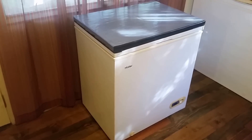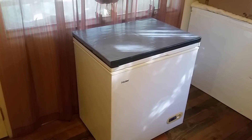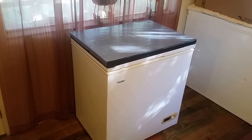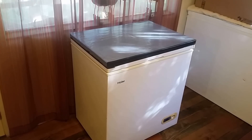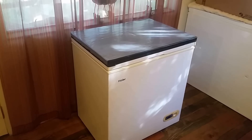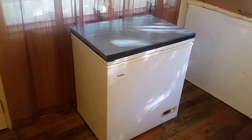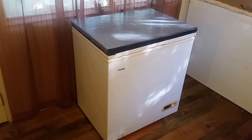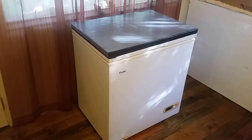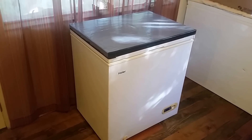I could run this refrigerator very easily on 200 watts of solar. What I started out with was two 100-watt solar panels, a really inexpensive charge controller, one 1100-watt Power Bright modified sine wave inverter, and a 100 amp hour 12-volt deep cycle flooded lead acid battery. I got this refrigerator off-grid easily with enough power left over to run LED lighting and charge laptops on just 200 watts of solar.